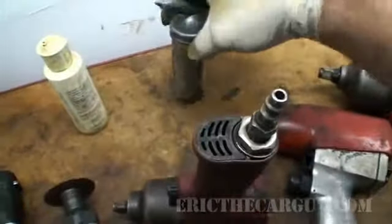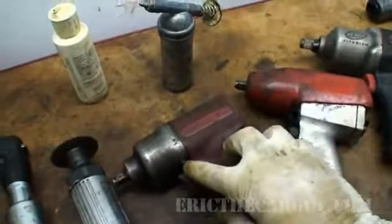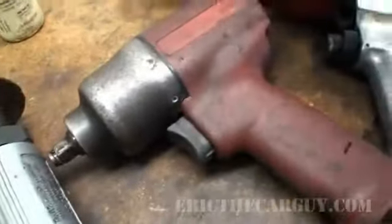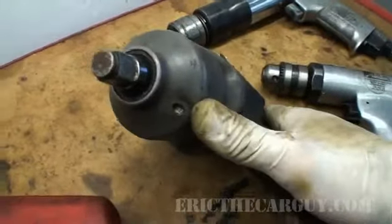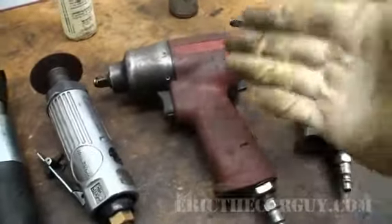And there's one more thing: I also have a grease gun full of lithium grease. On some tools, like this one right here, there's a little ball fitting that you can just pump a bunch of grease into, which lubricates the bearing on the inside. My half-inch impact also has one of these. I've always lubricated my tools — not obsessively, but I notice whenever I add the oil, if I'm not getting quite enough torque, I add a little bit of oil and it seals better and gets a little more torquey as a result.